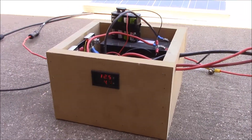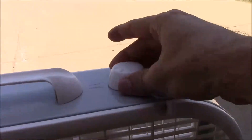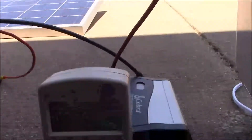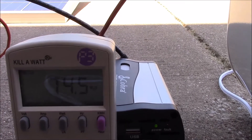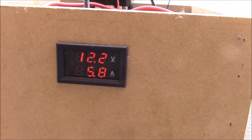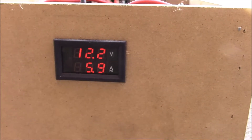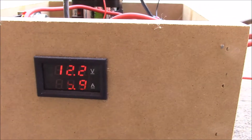I'm not too worried about that, but that's probably going to change if we crank it up — let's go straight to speed three. That is going to use about 75 to 80 watts, which will tax the battery and solar panel slightly more, dropping it down to 12.2 volts and drawing about five and a half to six amps.